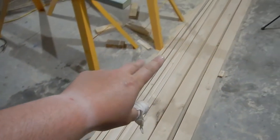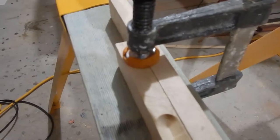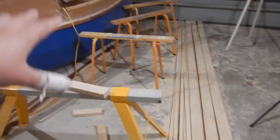I've got my staves tapered and my router set back up again. I just tested it — that's what the groove should look like. I'm going to set up all the staves and then I should be able to try and fit it together.